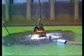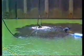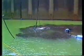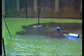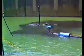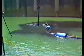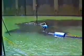We're going to be using the DP-150 pump here today. There's our DP-150 pump with the jetting rings. It's being lowered down into the sludge, suspended from a crane. It pumps into a booster pump, as we have 3,500 feet of 10-inch discharge line.